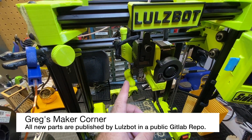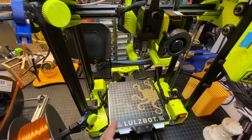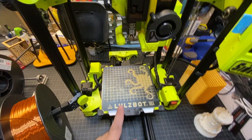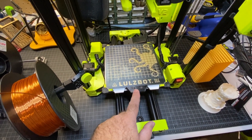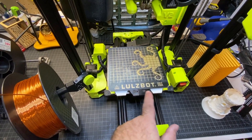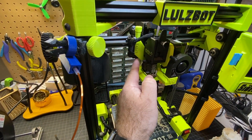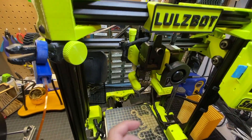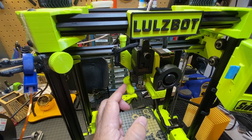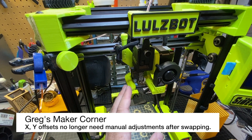There was also an issue with the tool head where, when you updated your firmware, the offsets you would have to fix for X and Y — otherwise you would end up potentially damaging your sheet. You can see I've actually removed the original piece and replaced it with the black TPU piece, because the nozzle had scraped over here. Luckily, they've redesigned this — you can see there's a V2 on it. They've gone through several revisions of these parts and these have been corrected.